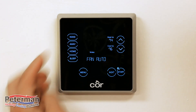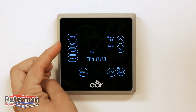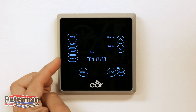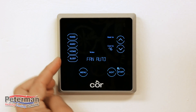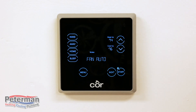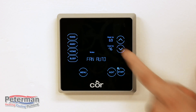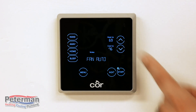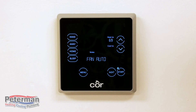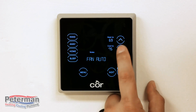We'll go select. Right now we are on the Wake setting — that's basically when you're waking up. The next step is Away, when you're leaving for work. After that is Home, when you're returning, and then Sleep. Over here is your heat setting. The 74 is blinking on the heat, so here is your adjustment. If you'd like your home to be heating at 69, you'll adjust up and down, then hit Next. Now it's moved to cooling, and you're going to adjust your cooling to your preference.